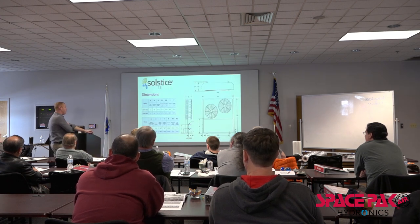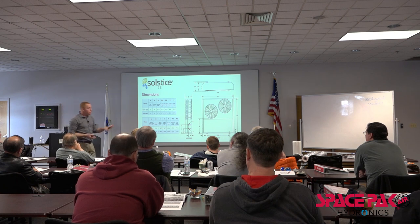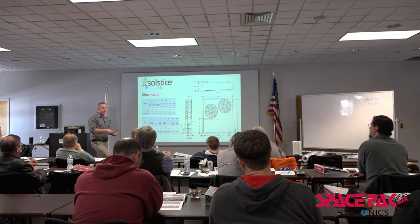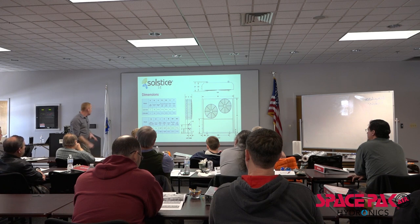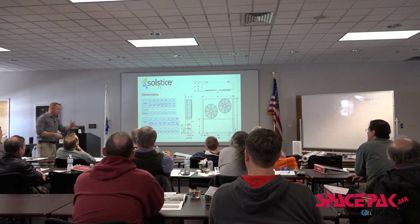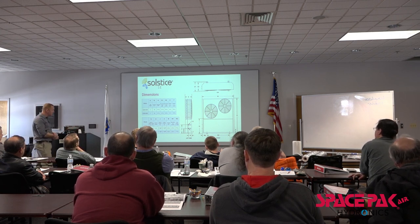So a little bit of information on this unit. We recently discontinued the 036, there was just no need because each one of these units has two compressors. So the 5-ton has two 2.5-ton compressors, so it's got a little built-in redundancy for that. 1-inch NPT connections in and out, it gets piped. Relatively big, we're gonna touch base when we get to turn them on and make them run out in the lab area.